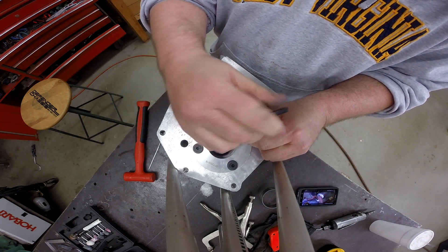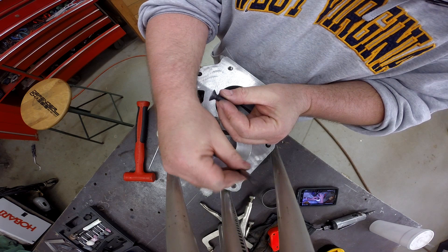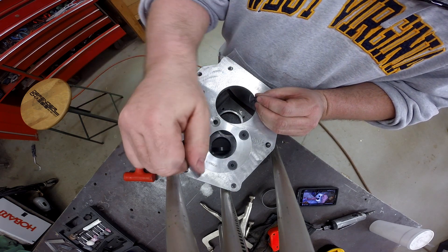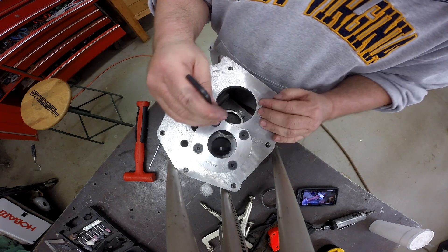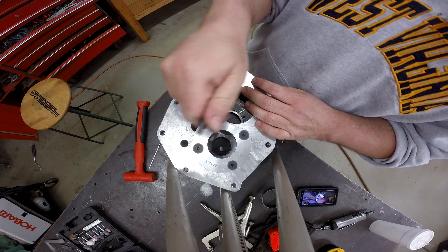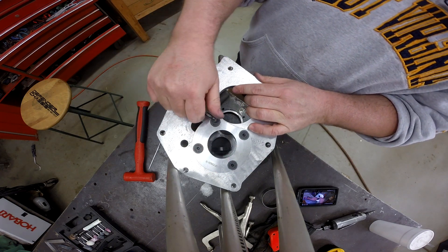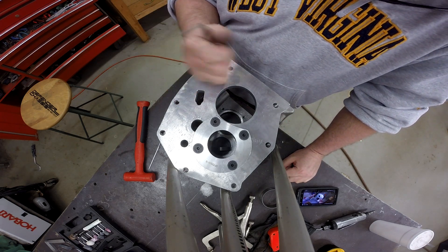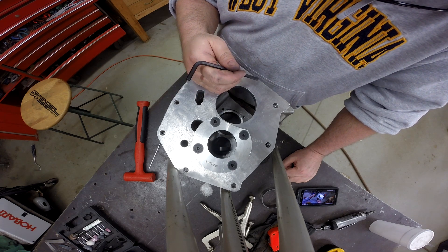The tough part about this style of bolt is that you really have to be dead nuts on, or the bolt will hang up on the side of the countersink. But as you can see here, with the other three in, it tightens right down into it — just how it should have been. So hey, thanks for watching — don't forget to like, subscribe, comment, let me know how you do this differently or if you've got questions, and I'll see you on the next project.